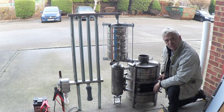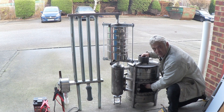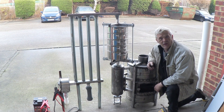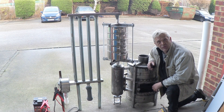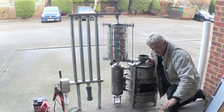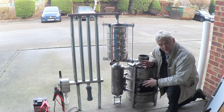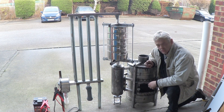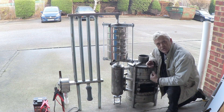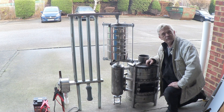This is started in the same way that everybody starts them: load your fuel in here, stick some newspaper, light it, door on, turn on the fan and we should get it to generate. Now it's supposed to burn just about anything — any dry biomass — but I was advised to do the first burn with charcoal. So I've got some charcoal here and that's the first burn I'm going to give it. When these were used during the war, charcoal was the favourite fuel to begin with. They began burning other stuff when the charcoal stocks ran dry.